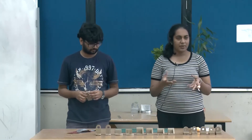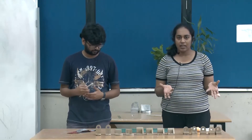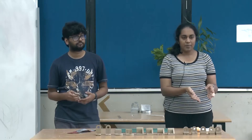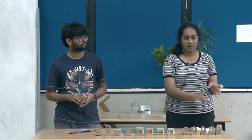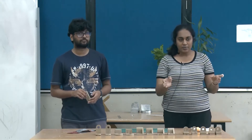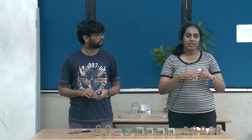The main difference between natural wood and MDF is that natural wood comes from the trunk of a tree, while MDF comes from agricultural wooden residues or by-products of natural wood. Another difference is that natural wood has a grain and a colour to it, whereas MDF only has an acquired colour. Since it is made from residue, it is much cheaper than natural wood, and it has a softness to it so it is very easy to work with.